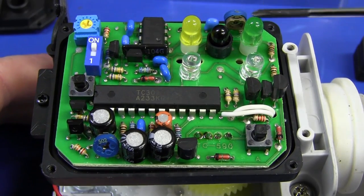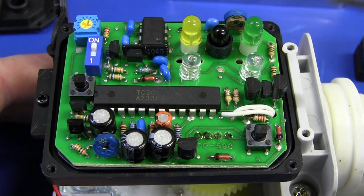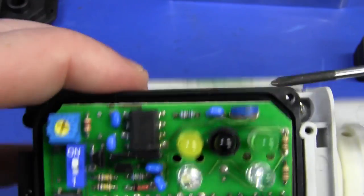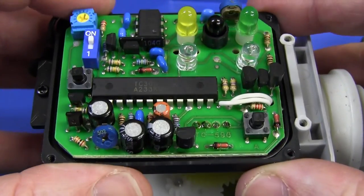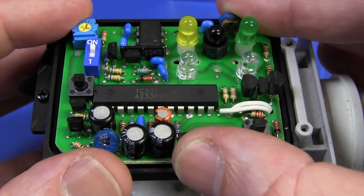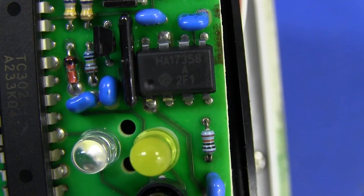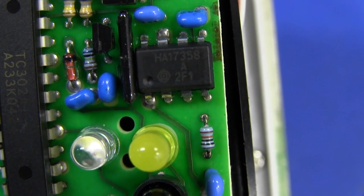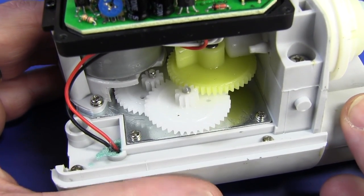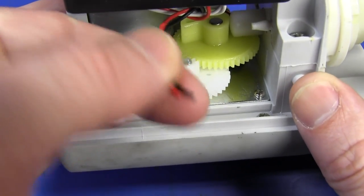It measures the distance based on that time period. There's a couple of internal factory set trim pots, and it's all through-hole stuff - discrete transistors, TO92 packages. There's a nice O-ring seal around the outside, as you'd expect in this sort of environment. That's got to be some form of microcontroller. The other chip is a Hitachi HA17358 - I'm going to assume that is Hitachi's variant of the LM358 op-amp. I want to power this thing up but I don't have any C-cell batteries. Well, there's nothing you can't fix with a pair of side cutters - we'll just hack into this thing and hook that up to our bench supply. Bob's your uncle.